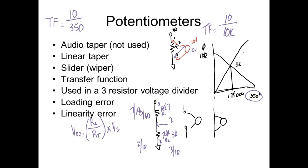So what would my transfer function be? Now this is volts, this is degrees. The volts are not going to cancel out, and the degrees are not going to cancel out, right? You understand? So my answer is going to be volts per degree. And that's why we say it. So we'll use this right here to represent per. So my answer should actually be this, volts per degree. All right, let's just put D instead of the little term. So what would be my transfer function?